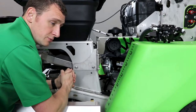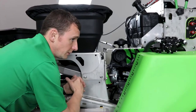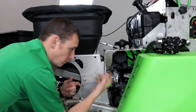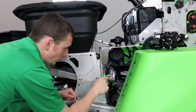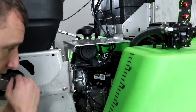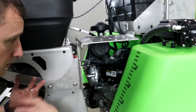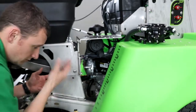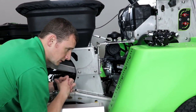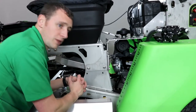One other thing to cover: with all the debris and dust in the air, it's a good idea to regularly blow the engine off with compressed air or a blower. The screen on top of the motor — you want to make sure you get any dust out of there, as well as keeping the oil cooler fins on the left side of the motor clean so it can breathe and do its job. I would avoid water contact with the engine as much as possible and stick to the blow-out method of maintenance.